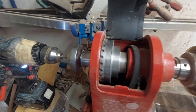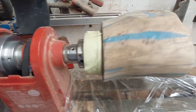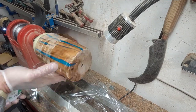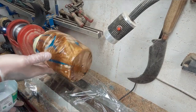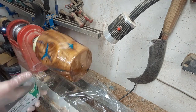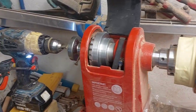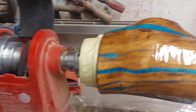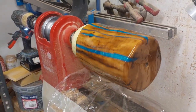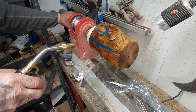Back inside. There we go — I've got the Makita drill, took the belt off the lathe, just running on the bearing at a nice low speed. I'm applying the epoxy resin with a glove instead of a brush. You don't get any hairs coming out of a glove but you do with a brush, and once you've finished with the brush you've got to chuck it away — so the glove is cheaper. Here we go, leave that for five to six hours spinning. Pop a few bubbles with a blowtorch.